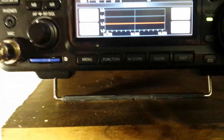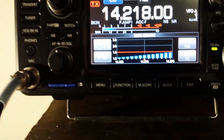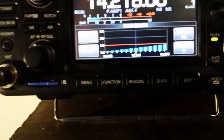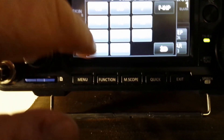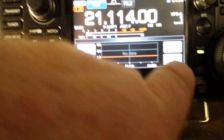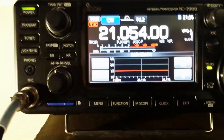We want 13 bars, and here we go for 20 meters. Our highest SWR at 14.278 MHz is still under 1.5. Next we'll go to 15 meters. Now this one is not going to be as good - I haven't really tuned the 15 meter band because frankly it's dead and I don't use it, so let's see what we got.